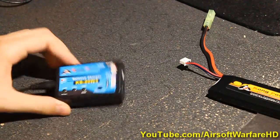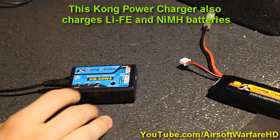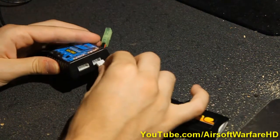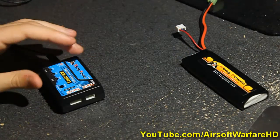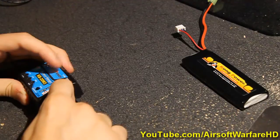Number two: you're going to want to get a nice LiPo charger, because your normal smart chargers are usually not going to work for a LiPo battery — LiPo chargers are way different than regular smart chargers. You're going to want to get a nice Kong Power one; this one costs about 30-something bucks. For a 7.4 volt you just plug it in like this, and it works. If you have an 11.1 volt, you plug in the adapter that comes with the smart charger and you can charge your 11.1 volt batteries.